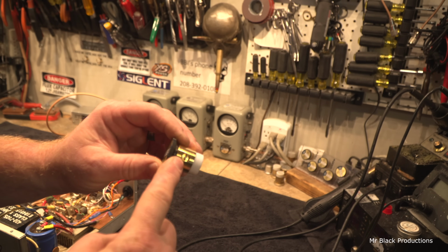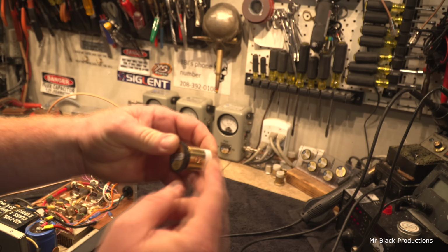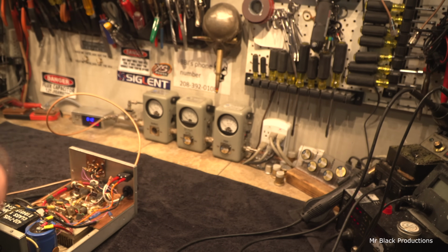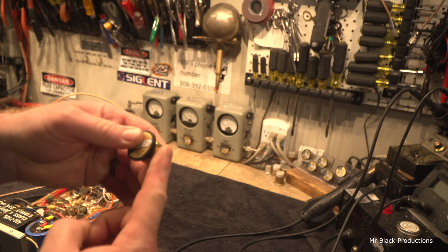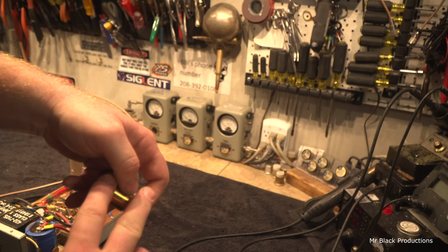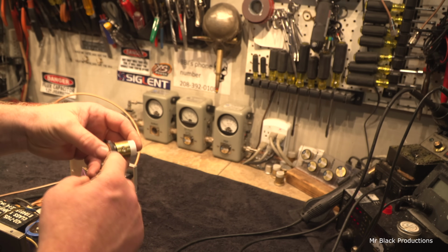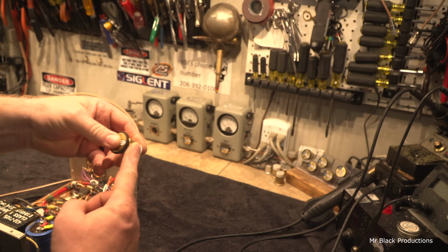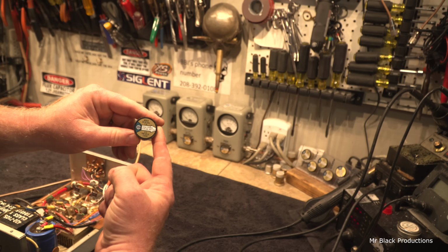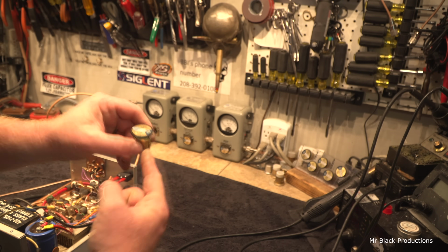You have this little slot here. Then 180 degrees out, you have this little slot here. And a little wiper arm inside the line section makes contact with that. So when the element is reading in one direction, it's making contact with this connector, but then when we rotate the element around, it makes contact with this connector.